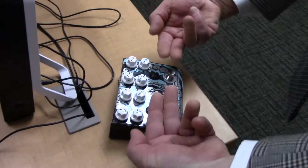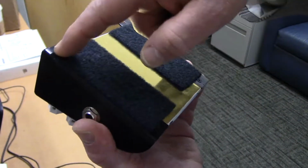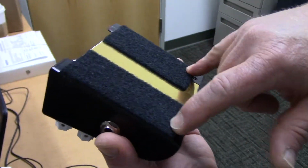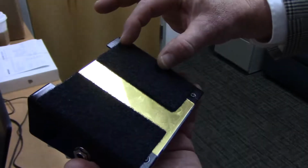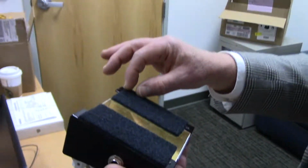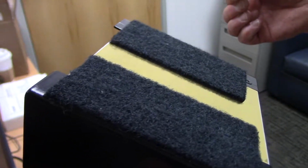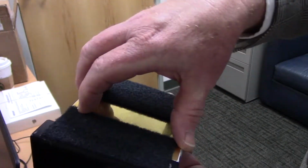Okay. So I was able to make my wire connections for the jacks, fold it in, and the original pedal had screws, 4 screws, right? Mm-hmm. I was able to use these screws here because they didn't make contact with anything, but your circuit board goes pretty much right up to the edge, like along here. So I made some little plastic screws out of some plastic dowel that I threaded, and wound those in far enough to keep these sides from swinging out on the pivot. And then I made this little plate to just snap down in there like that.